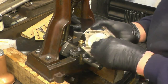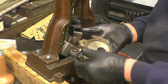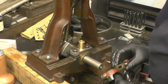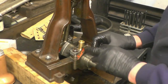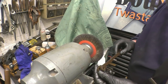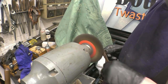The valve is operated by this thing — this is an eccentric, sometimes called an eccentric strap. The outer part and rod were really one of the best parts of the engine, absolutely beautifully made. I made the center part, which was completely missing. That goes under the crankshaft, and there's a rod that goes between here and the valve to control the valve itself. There's a little bit of surface rust on it — I just want to polish the rust off and clean it up a little bit, but not too much.